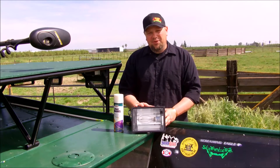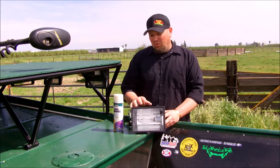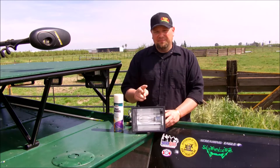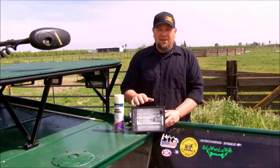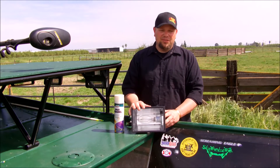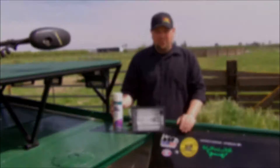What I have here is the 150 watt high pressure sodium light that I purchased for the LED light test. I'll run two tests — one at 3 foot, one at 10 foot with the lux meter. I'll then remove the reflector and paint it flat white, reinstall the reflector, and run those same two tests again at 3 foot and 10 foot. We can then compare those numbers and quantify if more light is actually leaving the housing after painting them flat white.